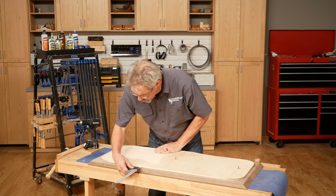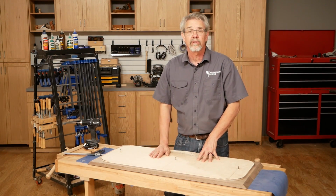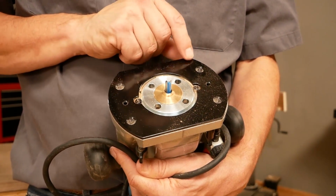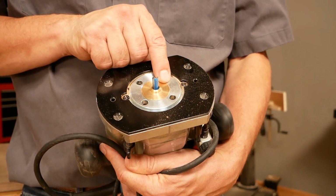Now, I'm going to register this thing 1 inch in, 1 inch in all the way around. Then I'm actually going to screw it to the top because we won't ever see those holes. So the tambour groove is cut with a 5/16 inch straight bit that's mounted in a plunge router. I also installed a router guide bushing which follows the end of the template, ensuring an accurate cut.